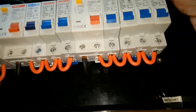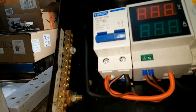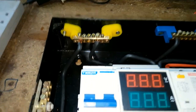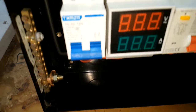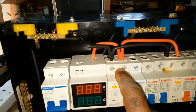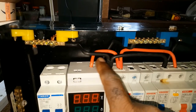This is what I use for the bus bars. This down here is to take the current for the leakage protection. This little thing takes current from here to light up that indicator. The transformer is inside here, so the wire — the live — comes here, passes through there, and comes out here. One end goes to this leakage protection and the other one goes here.